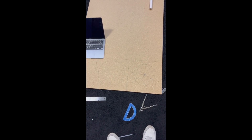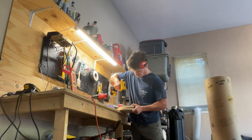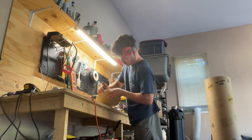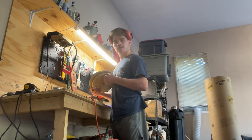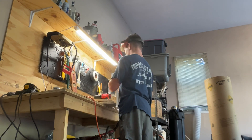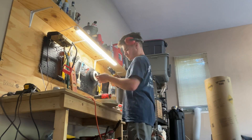Alright, here's the whole layout — you can actually see where the bolts are going to be. I also got a little scratch on my hand already on day one. So here's the first day actually working in the workshop. You guys can see I already cut out those circles — I used a jigsaw for that and then sanded the edges as smooth as possible. From there I grabbed a drill and started drilling down those holes where I marked them. I also used a recess bolt to make small gaps so the bolts can lay nice and flat and we have a smooth surface.